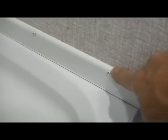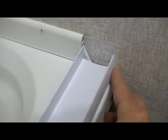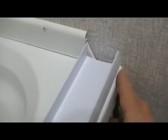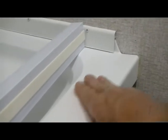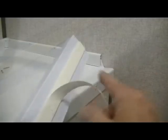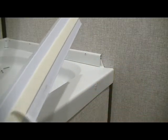By trimming the back trim piece around the tub — and did the same thing with the front — this allows our bottom track to set up against there and gives me just a little bit of an overhang on the tub. I can fill that in with caulking. Before we peel the double sticky off, we'll grab a towel and run a little bit of alcohol through here and clean it up. Make sure there's no grease or oil, and let it dry for about a minute. Then we'll go ahead and peel the double sticky off the bottom.